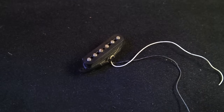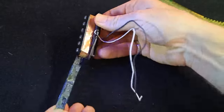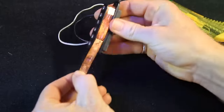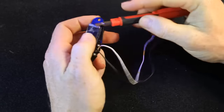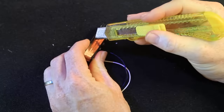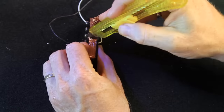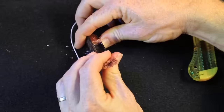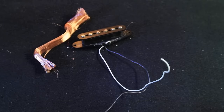Now firstly I'm removing the cap. This exposes the tape which covers the coils. There might also be another insulating piece of tape or copper strip like this. Now I'm removing the magnet. This is a ceramic magnet which is conducting through the pole pieces. Now this is a 6.3K wound single coil, so I'm cutting off the coils now. Now it's unusual for a bobbin to actually have the plastic core inside it - typically it just exposes the pole pieces.